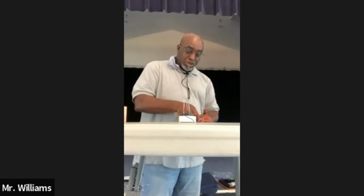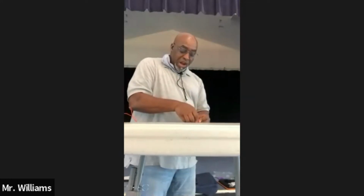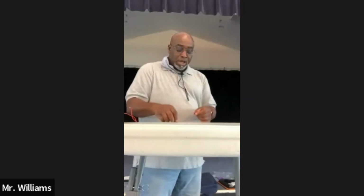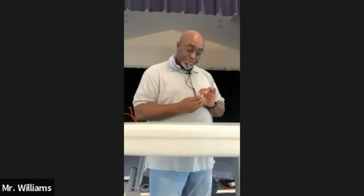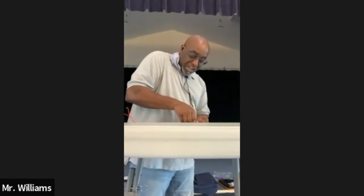Oh, one of the things we have to do with our wire, and that's another thing, you will get sandpaper. I have this little piece. And what you're going to do is only, I repeat, only remove the enamel off the top of it. Do not remove it off both sides, just the top. So you just place it down, whichever side you choose. And again, I've used this before, so I'm going to use the same area. I'm simply using the sandpaper, so you can see what I'm doing, sliding the enamel off the top of it. Okay, once you have all of the enamel off the top, you do the same thing with the other side. Okay, and you want to do the whole length of the wire, whatever's thinning out that you have.